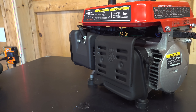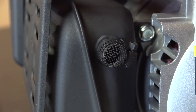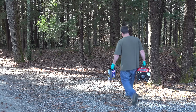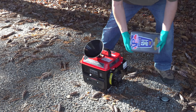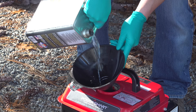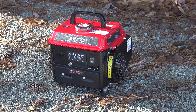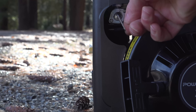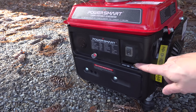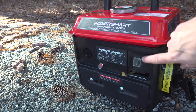The one they give you is just a cheap Chinese plug, so if you want to do a small upgrade you could replace this with a genuine NGK plug — this model would take a BP5ES. The muffler is all steel and it's surprisingly oversized. There's a spark arrestor around the back, but you can see the quality of that thing is not very good. Now it's time to start this generator for the very first time — I've never run this thing off camera and it has never had fuel in it before. First you've got to turn the fuel valve on, which is kind of hidden on the side. Once it's in the on position, switch the ignition to on and then slide your switch all the way to the start position because that will close the choke.